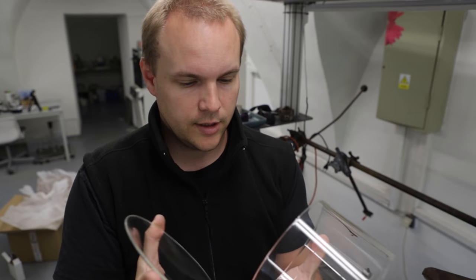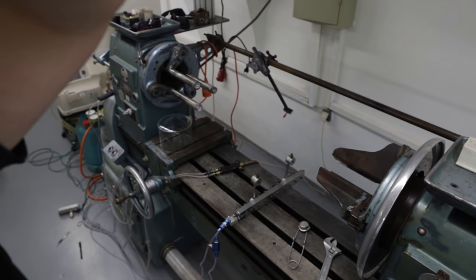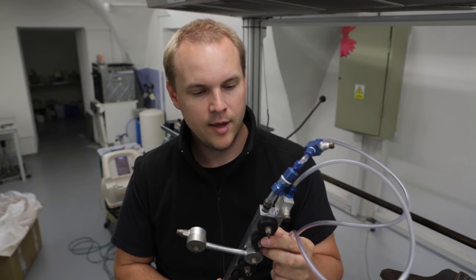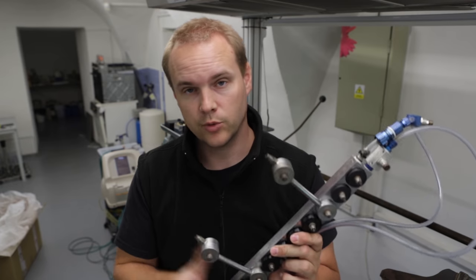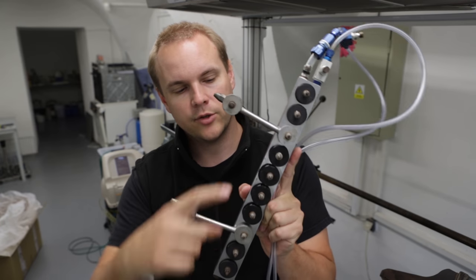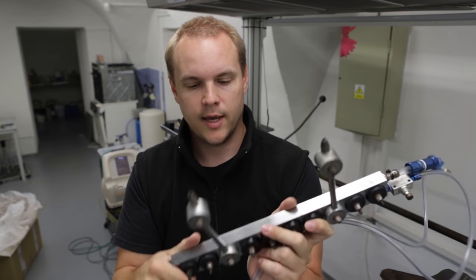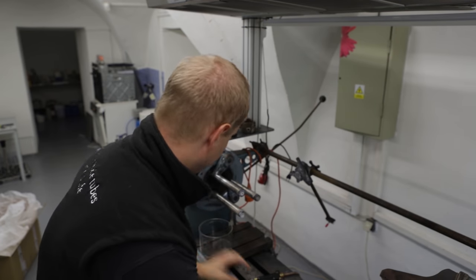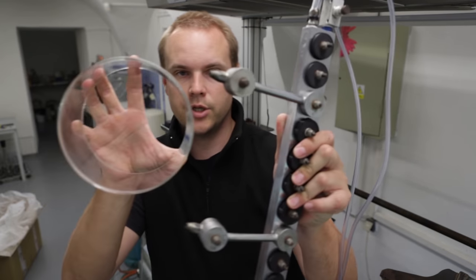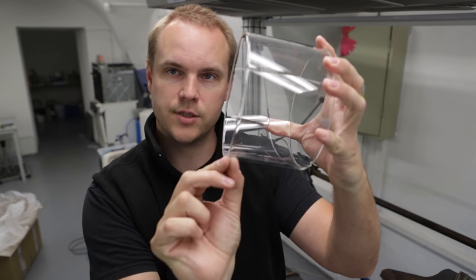This is one thing. Another, I have here a lathe burner. The main problem, as you pointed out in the comments, was that I didn't have enough power with the small handheld torch. So today I want to try using this lathe burner. I will add two more jets so that it provides more heat, and the glass will be heated tangentially, like this, so that only a thin strip of the glass is heated.